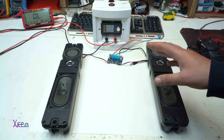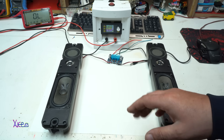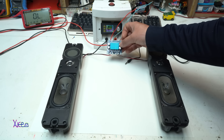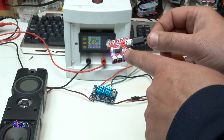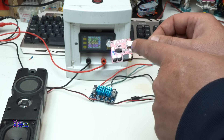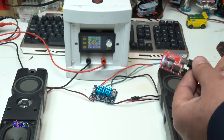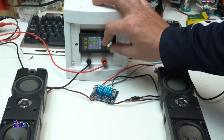All wires are now connected. I have left and right speakers — these speakers I bought from a local flea market; I don't know where they were pulled from, maybe from a car or old TV. Here is the amplifier module, 2 times 15 watts, Class D. Here I have a small Bluetooth audio receiver module that will receive the song from my smartphone, and through the 3.5mm jack will be the audio input for the amplifier. I will set the power voltage to 12 volts.